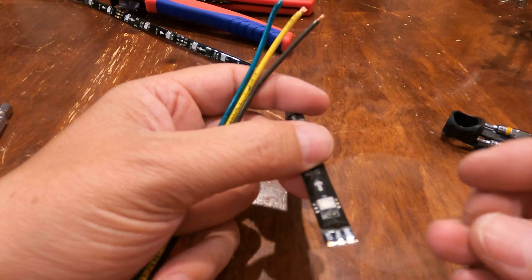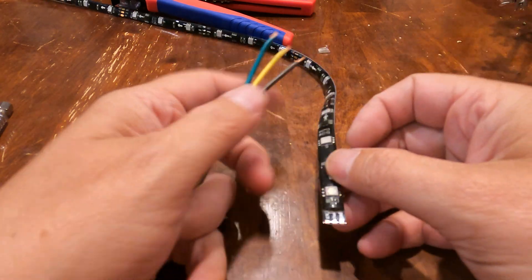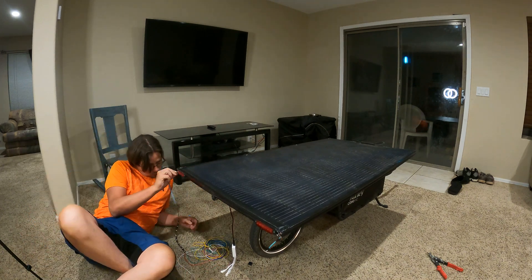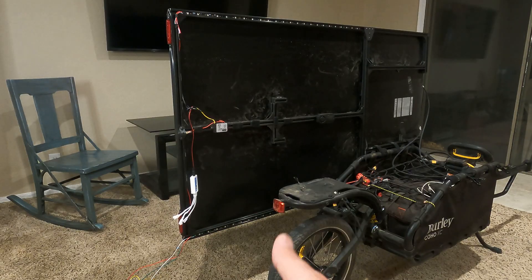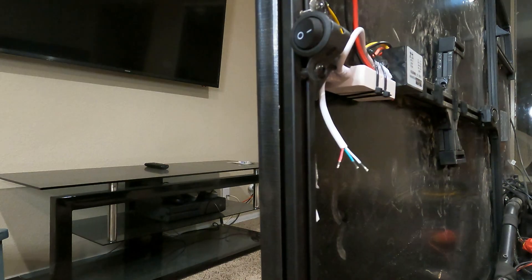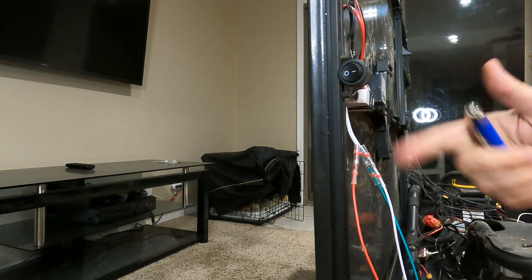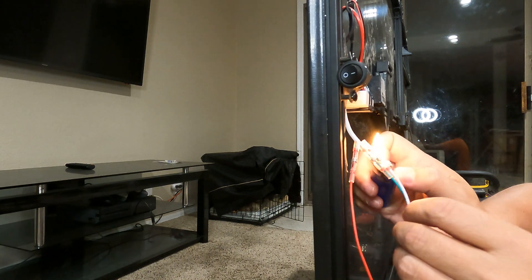Now that I've cut the strip and want to add a new wire to it, it's pretty simple — there's silicone on it to keep it water resistant, you just peel that back, cut it off, and then solder on the wire. I'm going to cut the two ends of the controller wires to get them hooked up nice and watertight using the heat-shrink solder connectors. I also need to zip-tie the controller up by the switch so that if needed I could reach under and turn it on manually. Using a lighter again since I'm too close to the solar panel for the heat gun.